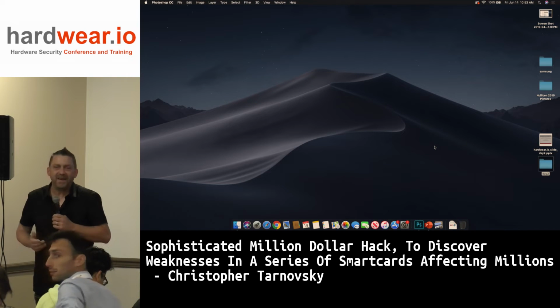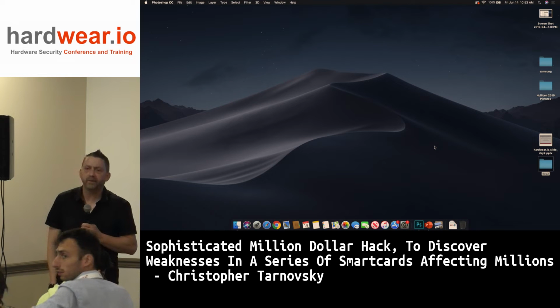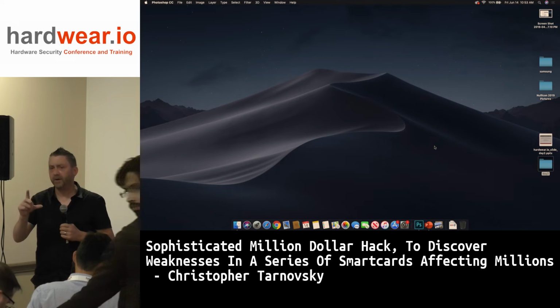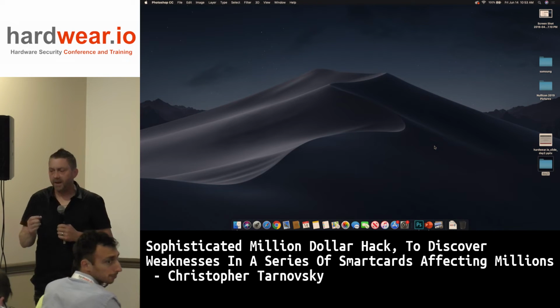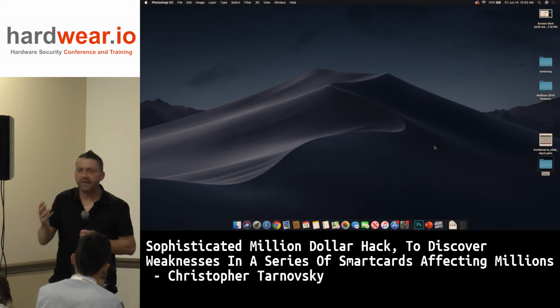I haven't. It hasn't been an interest to me. I have never seen them. I mean, if you can spot single cells of non-volatile memory, you can spot them very fast. They're very large. To do a single cell of double-poly EEPROM for a fuse bit in a chip, it's a large block of logic just to get that done. So you can spot single cells of double-poly EEPROM, for example, in the ST processes.